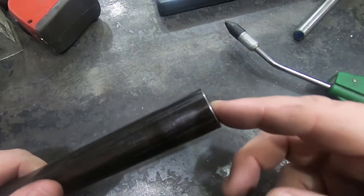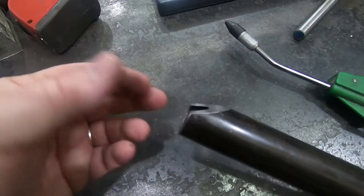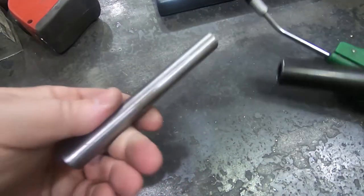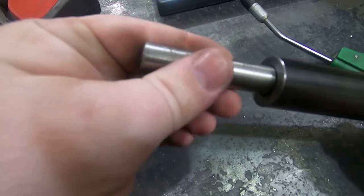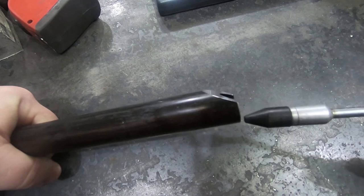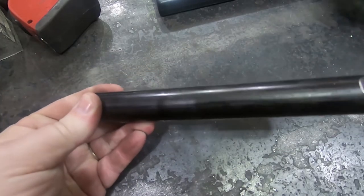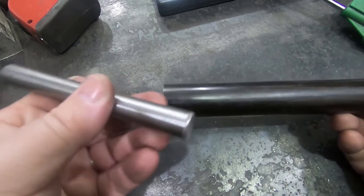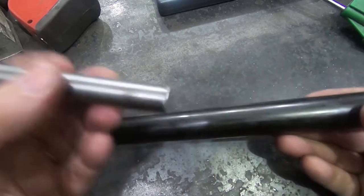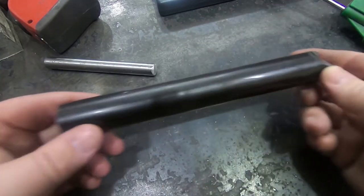So I'm thinking that for what I want to make, this is probably good enough. I still might try making the flat and wide aperture to see what that looks like, and I've also seen some other pipe organ designs that might be fun to play with. The other thing I discovered is: I cut a section of that rod which fits in here but sloppily — there's like a 16th of an inch free — and with it in there I can't make it work. So not only do I need a sliding piston in there, but the seal needs to be pretty tight. Maybe I'll put some leather gaskets on the piston to keep that airtight seal better than just a brass-on-steel interface.